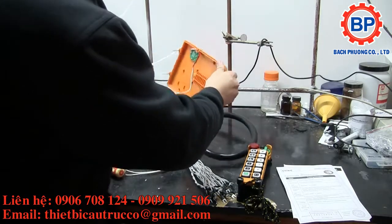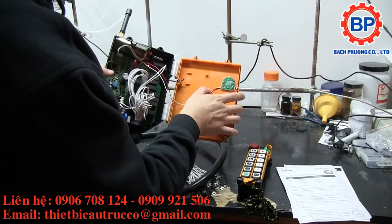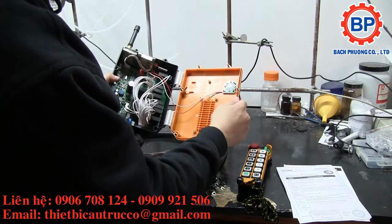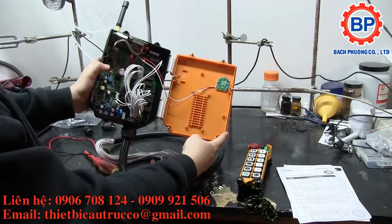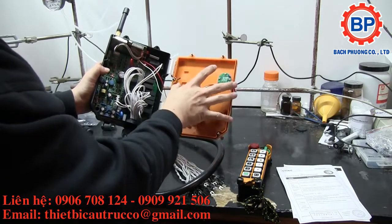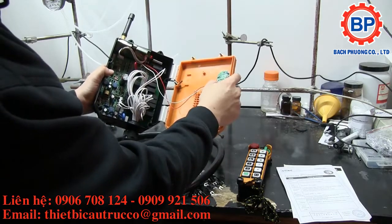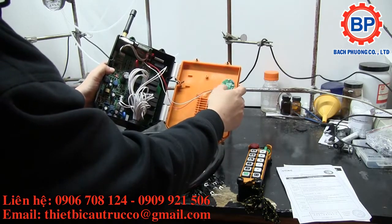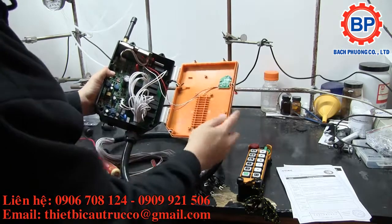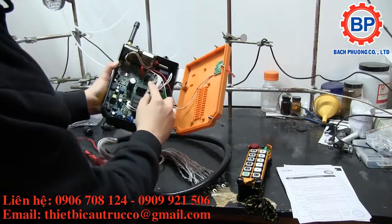In China you might. Let's see, right on the inside we have PP/PA plus 30% GF, so it's actually not that bad of a piece of plastic. Also looks like it's got a gasket wired in here, so looks like this front LED is just 2 wires. There's nothing fancy or special about it. A couple resistors for it. And then we get into the real guts of this thing.